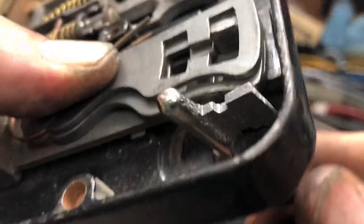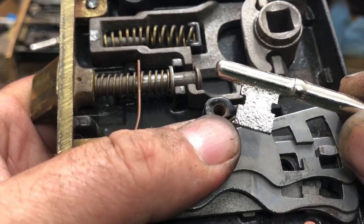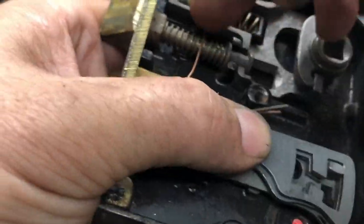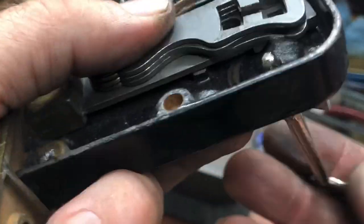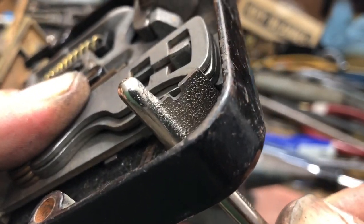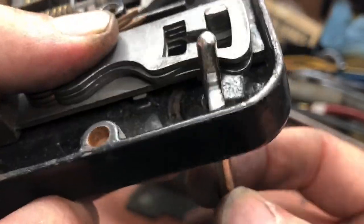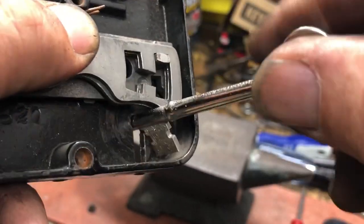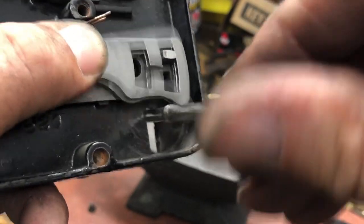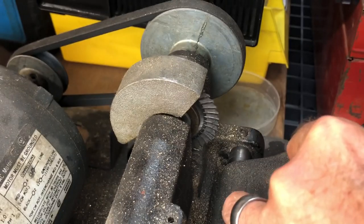So we need to leave everything alone except for the very center and the very tip cuts, and it would be tip on both sides. So stay on, spring. Stay there. Coming from this side of the lock, you see where it contacts. Contacts right there on the front. And it's not going all the way, and then the center. So you have to do both outside edges and the center cut. And typically it'll sometimes mark. I don't know if it's marked or not. Let's see.